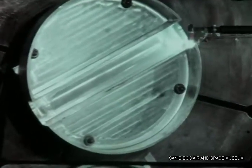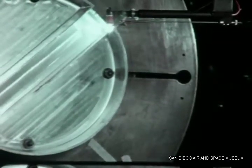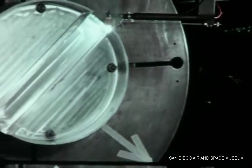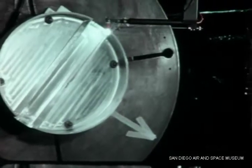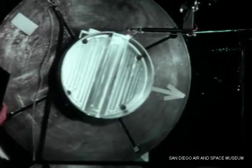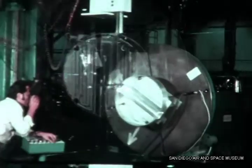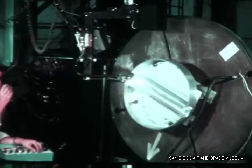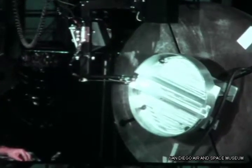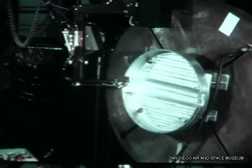The torch also has an oversized conductor cable for operating beyond its normal current rating — 300 amperes are delivered in some areas. A key to obtaining consistent weld penetration and bead contours is the use of a special pre-placed weld backup tape under the weld joint of production assemblies.